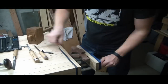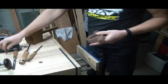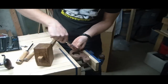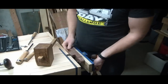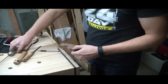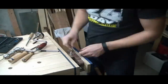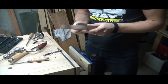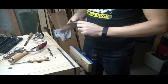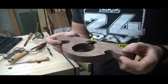The next thing I need to do is make a recess in the bottom so that the blade could go completely flush. That was a fairly simple thing — I took the blade out and cut that notch for the blade to slide into the body, so if I needed to cut a hole that was only a sixteenth deep, I could still do that. Now with the blade fitting and everything running well, I need to put in two set screws in the back to keep the blade from sliding around. I measured the thickness of the shank on my thumb screws and drilled a hole that matched that, so that when I ran the thumb screws in they would self-thread themselves into the wood.